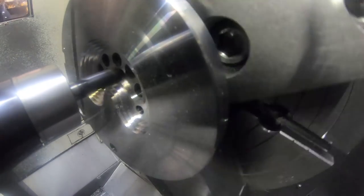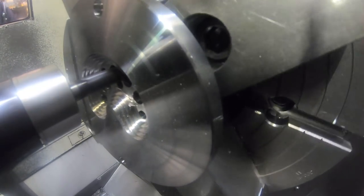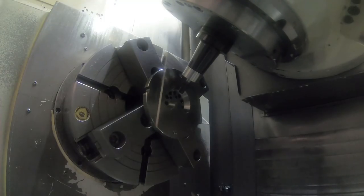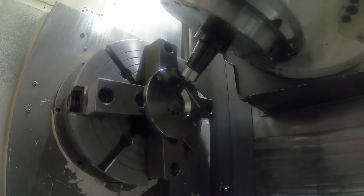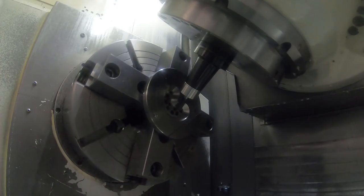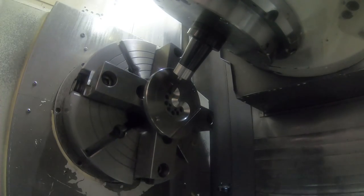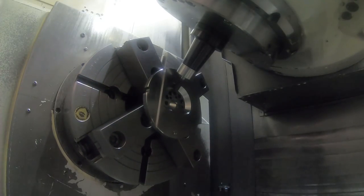The next part of the video, you're going to see a 5-axis move to mill that 45-degree angle on the outside wall of the pocket here. It's going to be this here. And that's the reason I stuck the end mill further out in the collet chuck. Didn't want that nut to hit the part. Just wanted to be sure I had enough clearance. It's not really a full 5-axis move per se, because the B axis stays pretty much at 45 degrees. It moves a little bit, so it is really a 5-axis move, but it doesn't move very much on the B axis.